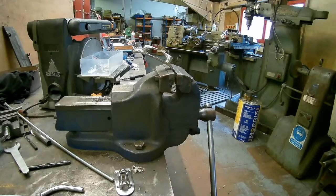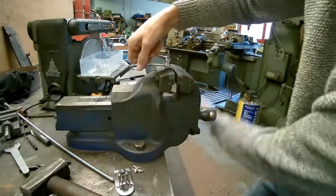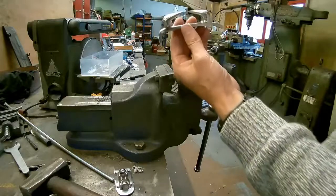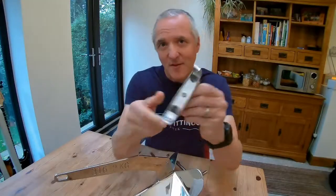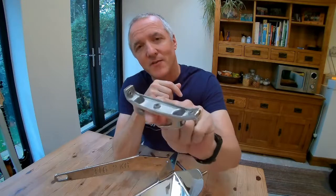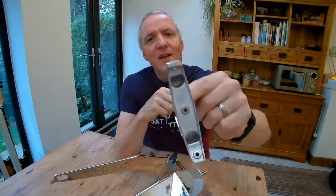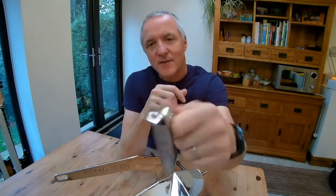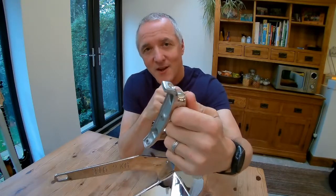At this point I can say this grade of cast stainless is pretty ductile. I don't even want to break it now — but that's a nice image of just what the metal can take without breaking. Here's a close-up of the fairlead we've bent in the vise. This end has gone about 90 degrees and it's still hanging on in there. We've got some evidence of strain on the material, but no cracks. That's pretty extreme, just to give you a feel for what this kind of material can take.